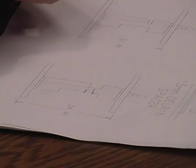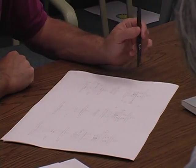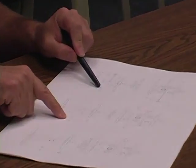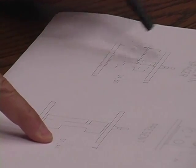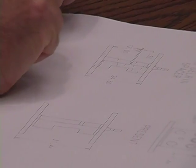What is the reason to remove the existing 3mm aluminum spacer? We never wanted to fly a spacer there. That spacer is only in there for the Goddard test, with the condition in which the mirror is 5 mils shorter than nominal. In order to do that, then we have to remake the middle piece, and we have to remake the piece that will ultimately be attached to the camera. And what you see is we are 6.5 millimeters shorter than nominal, with a 0.5 millimeter of adjustment range. So that means we got a total of 7 millimeters shorter than we are at present. So the 7 millimeters plus the 3mm shim is the 10 millimeters that we need to save.